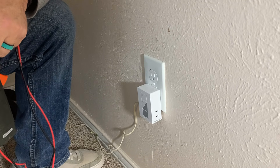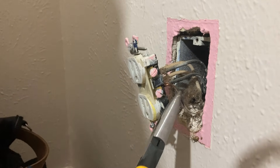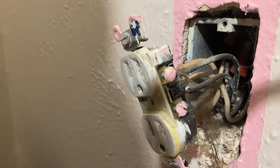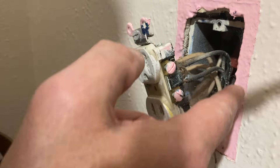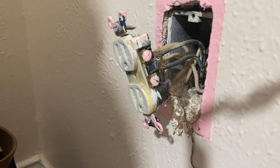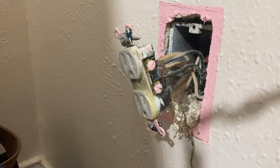I already opened this other ancient plug and you'll see a ground wire right here against the hot — that's our short. Something like this isn't always that obvious, but I've had ground wires rolled up that finally touched after 20 years. Sometimes in outside plugs, the older metal boxes have a loose plug that's been banging against the side and shorting out. Now we're going to clear this, and then go back to the upstream plug we divided in half and put the meter on it to confirm the short is cleared — using the meter, not resetting the breaker.